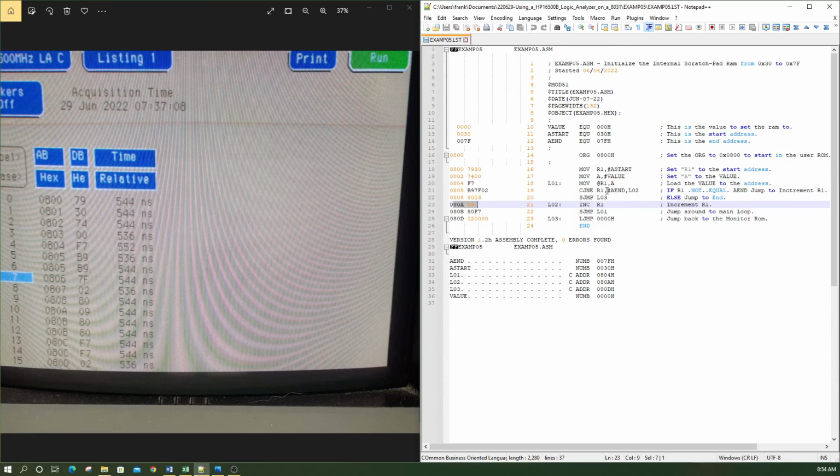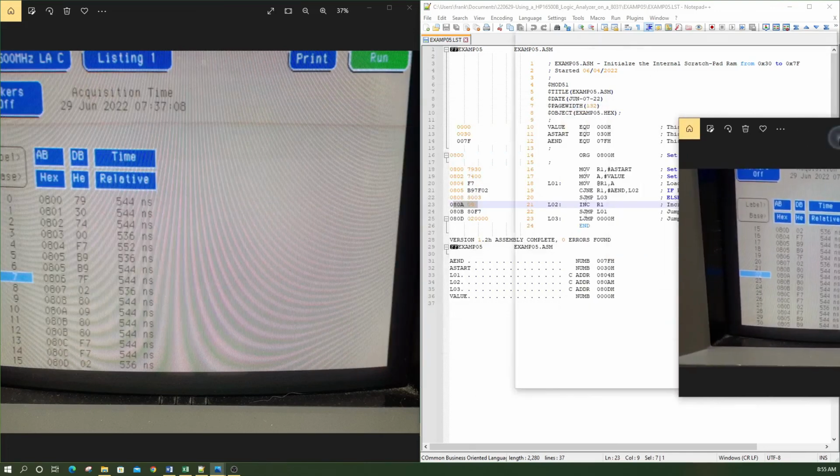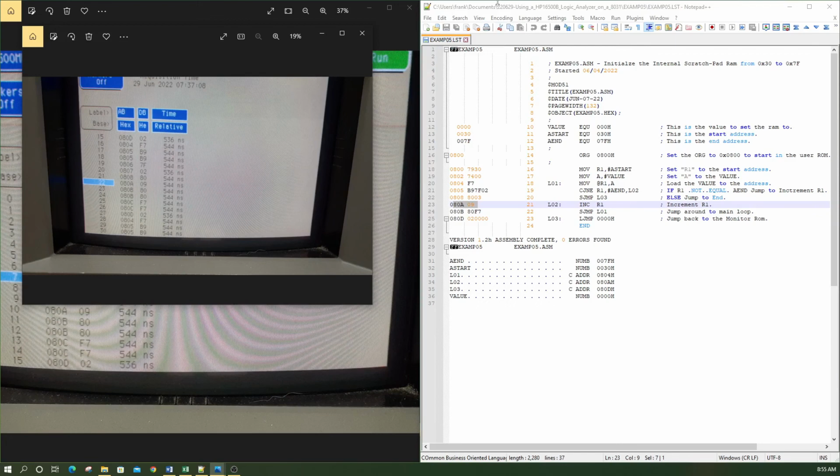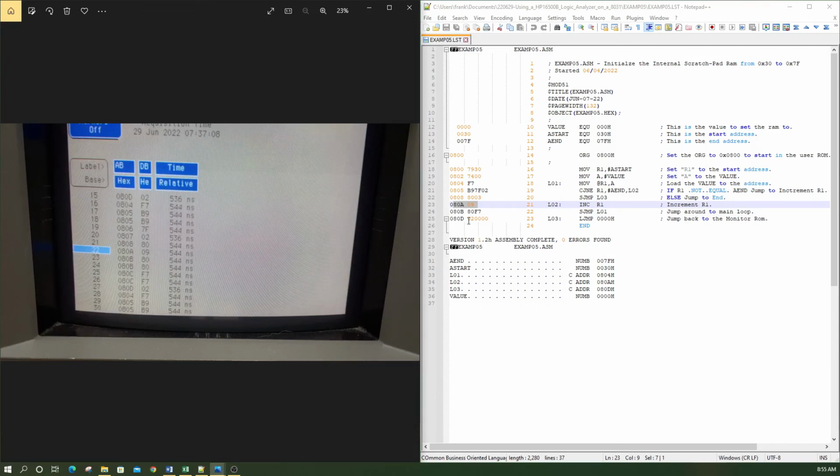So yeah, you can see what's going to happen here. On the first go around, it's going to jump to label 2, so it's going to skip this one and jump to that label, and then it's going to go to 80B, which is 80 F7. So from F7 it goes to, you see it hits 0D, but it's supposed to jump back to 804. So let's take a look at that one. I have it on the next picture here. If I can get it to come up. So we'll look at that. Let's see, we got that. Okay. What I gotta do is hit that, and we're going to get the next picture. Okay, so you can see the 80D here, which has the 02, but then yes, it jumps to 804, which is F7.